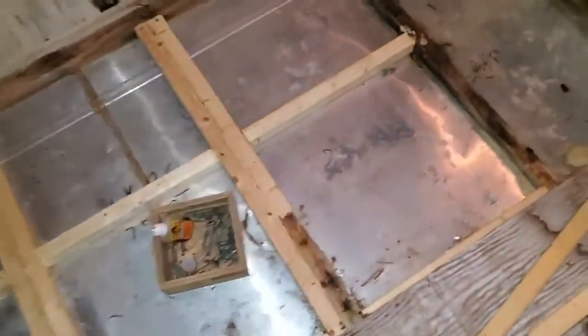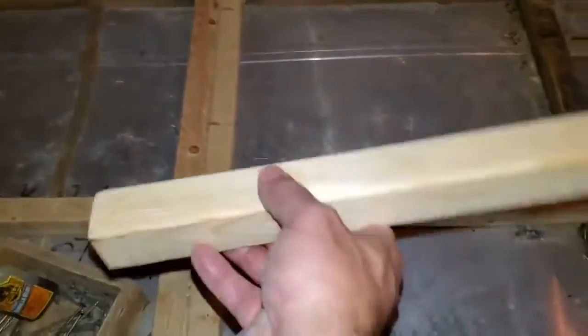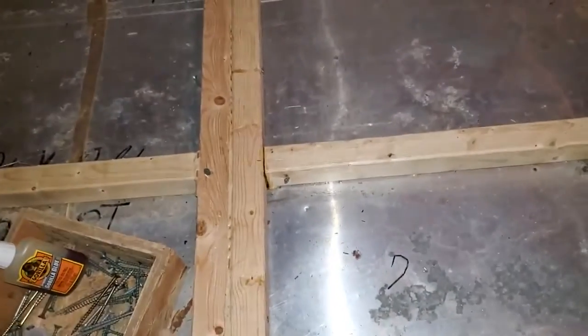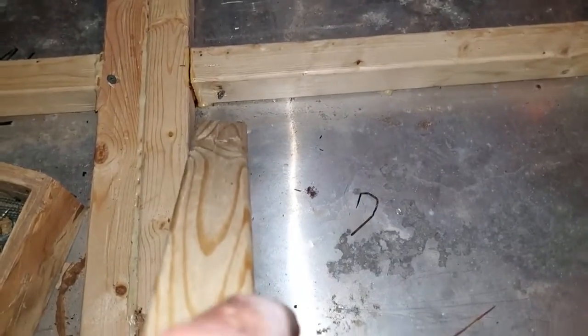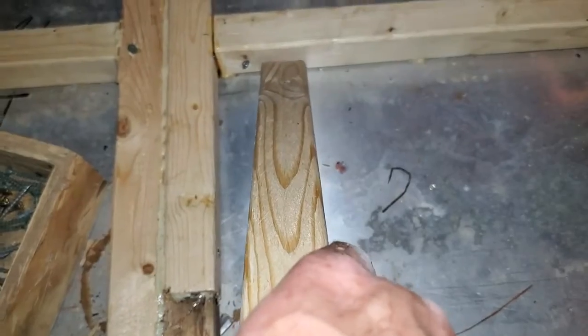At this point I'm putting in just two by twos — they're pre-cut. As I get them in, they're not completely fitting; here's a little gap, so we're filling that in with some gorilla glue. That'll bring it together and form a really good bond. We're also shooting in some screws — not using any nails — screws going in at different angles.